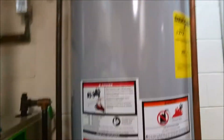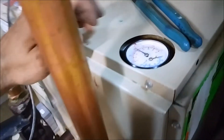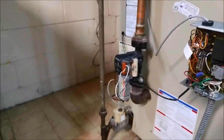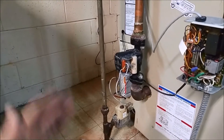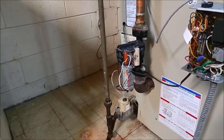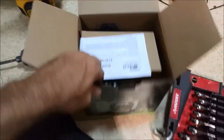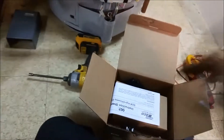We just installed a new 50-gallon hot water heater and I had to replace my temperature pressure gauge. When I got the thing back up and running, my pump would intermittently work — had voltage but the amp draw would go up and down. Got all the air out of the system and it still didn't want to work, so we're going to put in an ECM high-efficiency pump.